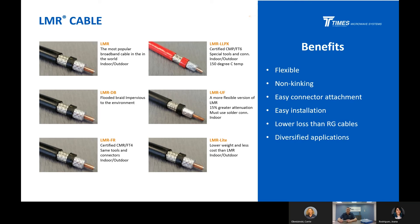The FR product is a fire-retardant product listed as CMR by Underwriters Laboratory. In addition to being fire-retardant, it's also low smoke and zero halogen. Our LLPX cable is our CMP-listed cable that can be used anywhere in a building — horizontal spaces, vertical spaces — and it meets the UL Steiner Tunnel Test. The Ultraflex is a very flexible version of LMR, designed for in-the-box use, getting under cabinets, with a rubber jacket and stranded center conductor. And the LMR Lite replaces the copper braids with aluminum — if you've got very long runs or are air-shipping product, it's something you may want to consider.